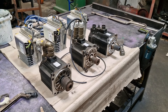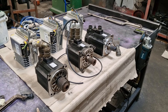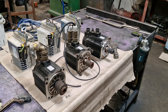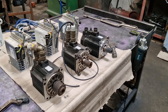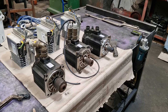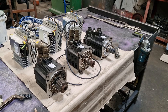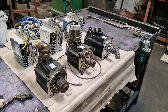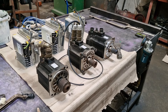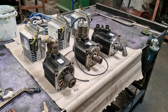When I looked at planetary gearboxes and woke up after passing out, they were a thousand pounds each. I cannot afford three thousand pounds in planetary gearboxes — that's just crazy. There are cheaper ones out there but my only concern is backlash. So I think what we'll do is build our own belt drive system. It's a pity because we could do with the laser accuracy to make some of the components, but we're going to rely on the plasma, a lathe, the little milling machine, and the press brake.